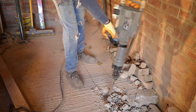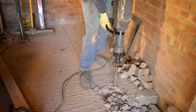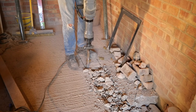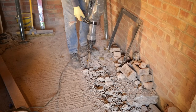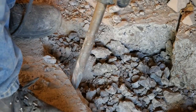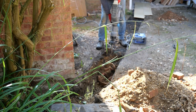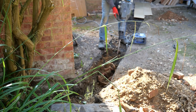In this review I'm breaking through a garage floor of 14 centimetres deep in concrete. Whilst it takes several attempts, it does easily break the floor. Using the breaker to dig a trench, it easily opens the ground — it usually goes through earth mixed with bricks. On both breaking types the breaker gets stuck and is difficult to pull out, but that is more down to technique.